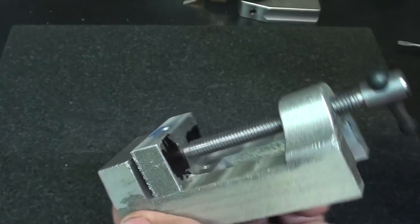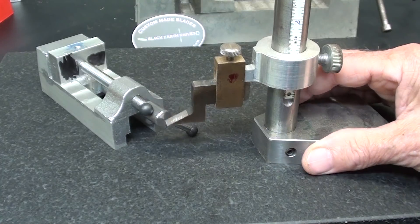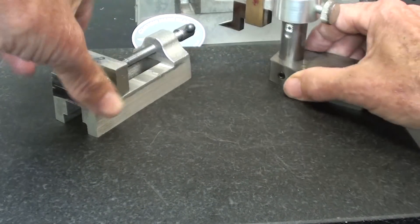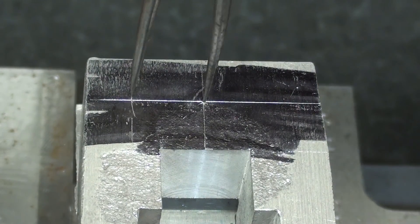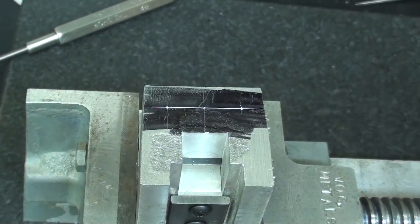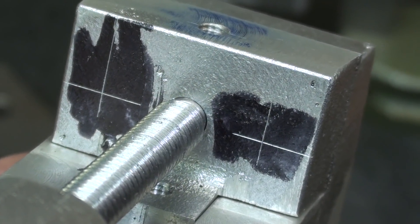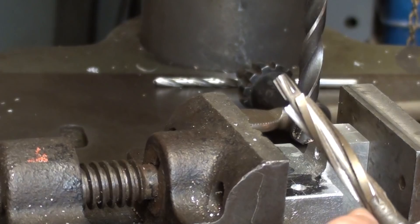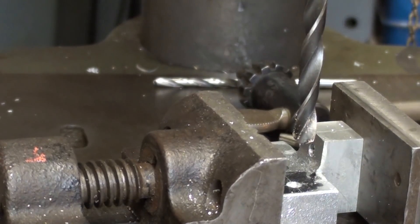Next, I will locate two holes here and two here, not unlike what you see on this vise. That's how I'm locating the center. And now to counterbore for the socket head cap screw. I do not have the right size, so I'm simply using a drill bit of the appropriate size, which is one size under one-fourth.